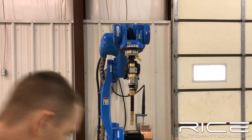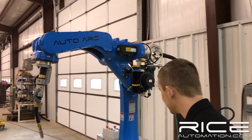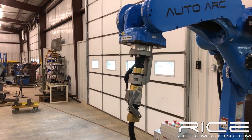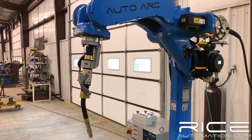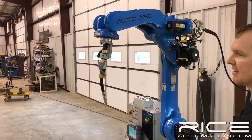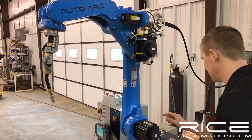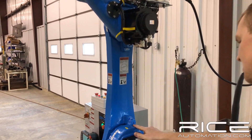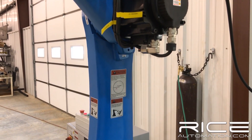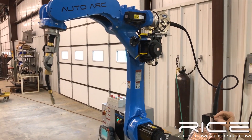One thing to touch on — all over this robot we've got the zero marking stickers, which is normal. But after a while, most of the time those get worn off. Generally in robotics you're looking for witness lines and they're hard to find once they've been picked up. So on each axis, you'll find a hole — these are your alignment holes. You can actually stick a pin in there and align it, and that'll get you back to factory zero.